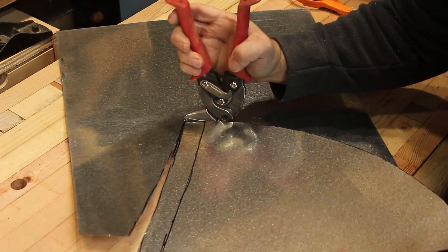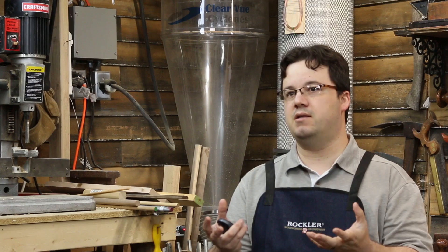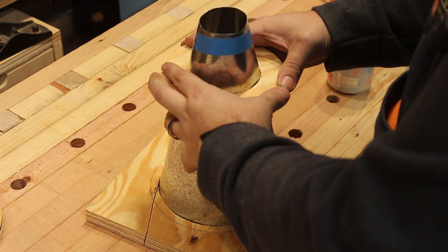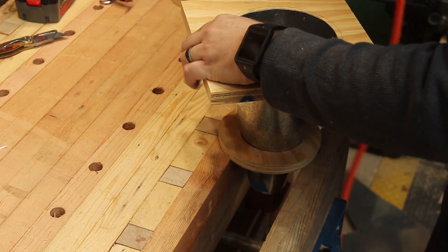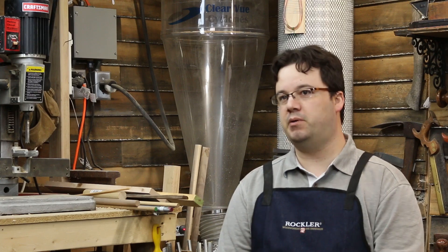Sheet metal is expensive, so I just went to the home center and in the HVAC section you can get these things called joist pans. They're like six bucks and they're just the right thickness. You have to work it a little bit to make it pliable — you don't want to kink it. I even used some wood scraps to help form the cone. I forgot to wear gloves. You might think you're not getting cut, but wait until you wash your hands and feel all those little tiny cuts you didn't know about burning.